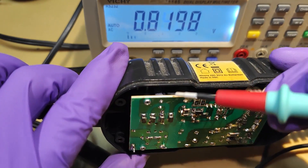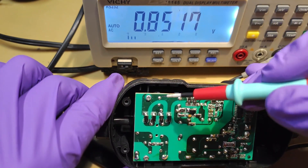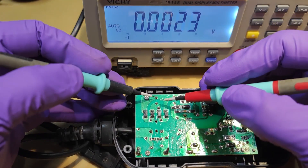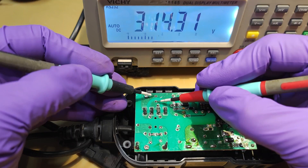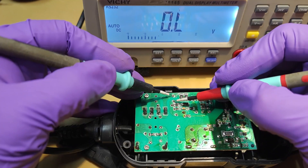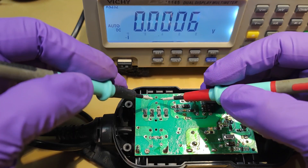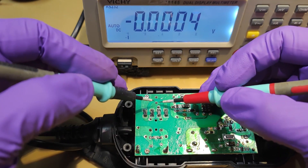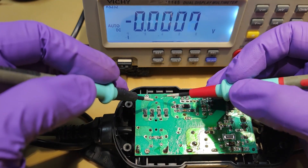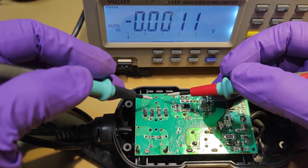If you take a look just here, you can see a capacitor and another capacitor. Let's just check if there is voltage on it. Okay, and the other one — there is probably a resistor or an inductor making the connection between those two leads. This kind of inductor provides the circuit the ability to reject some high frequencies on the mains.